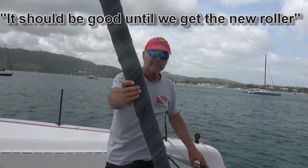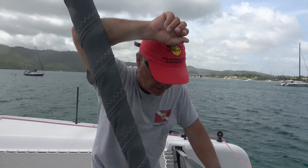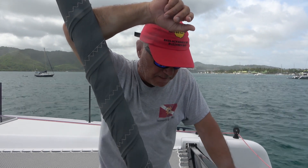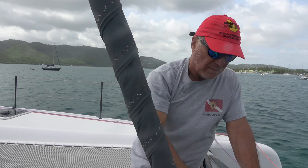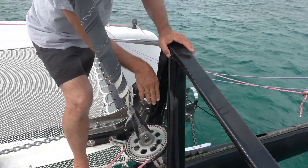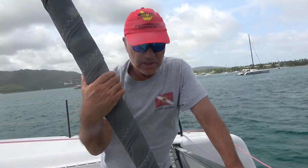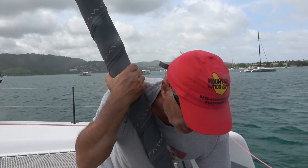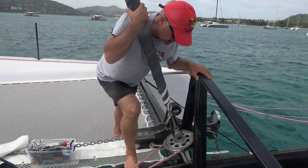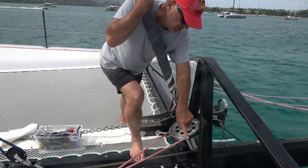They are putting a smaller roller on. The roller was clearly too large. The problem with carbon fiber struts is they're good in compression and tension, but certainly not sideways loading — it's really bad. You certainly don't want the roller touching the carbon fiber cross, especially going forward. The Dyneema will prevent it from moving sideways, and they'll do the same thing on the other side.